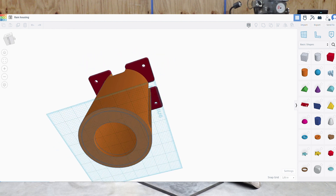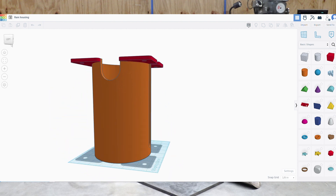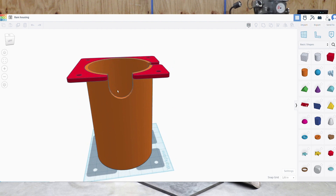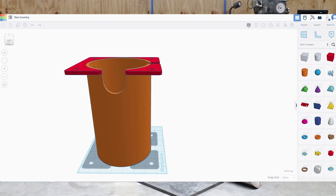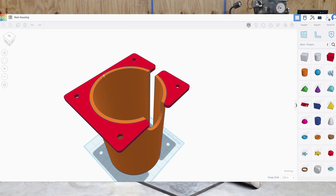The body is going to be cut on the plasma machine, cutting out the D-hole and the hole for the connector. On the bottom is our ring, and this ring simply supports the ram and allows it to extend through the hole. The ring is only holding up the weight of the ram itself. None of the forces generated by the ram are going to impact this structure. The ram is going to be about an eighth of an inch below this mounting surface so it has a little room to float, and when it starts to press, the body of the ram will go up about an eighth of an inch and press against the upper beam, with the rest of the force exerted through the ram straight down. This piece is doing nothing other than holding it in alignment.